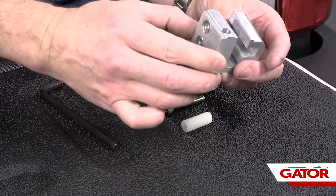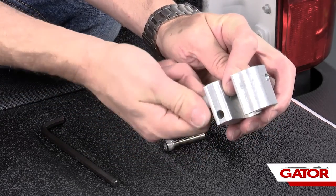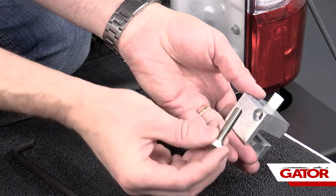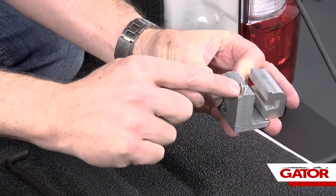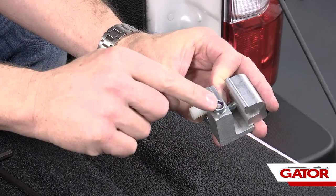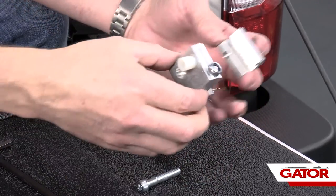We're going to take one of our clamp assemblies — we've got two per side. We've got a nylon set screw that goes into this threaded hole, and we're going to thread that all the way to where the nylon reaches the back side of the clamp, keeping it flush. On the bottom side of the clamp, we're going to take our long threaded bolt, set it through so it falls into the pocket. We've got a groove cut into the top of the clamp, and we're going to take one of our nylock nuts and thread it onto that bolt until it hits the nylock. Then we squeeze the clamp together, take the bolt out to separate it, and set our clamp to the side.